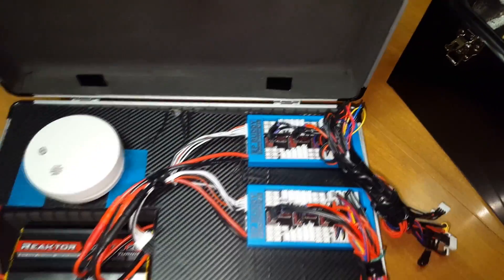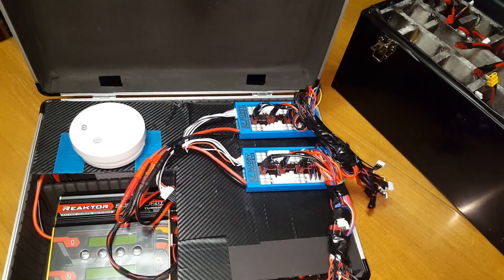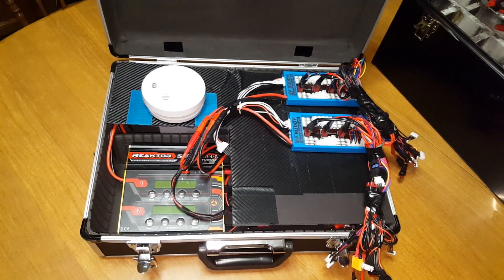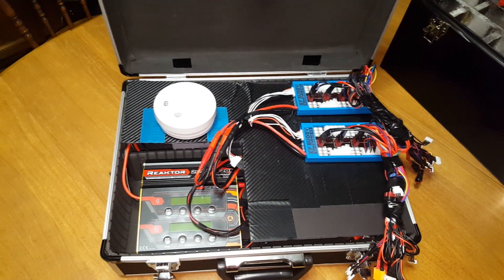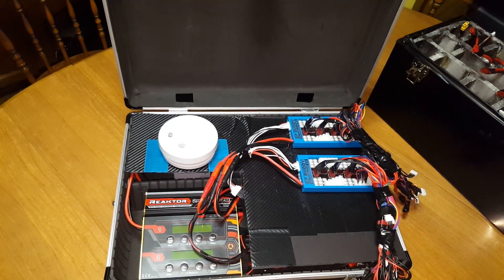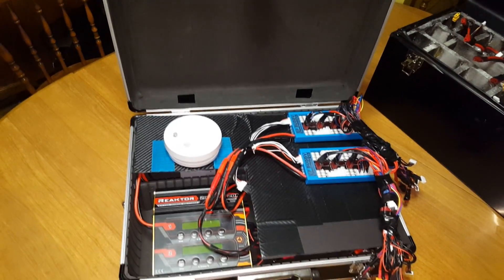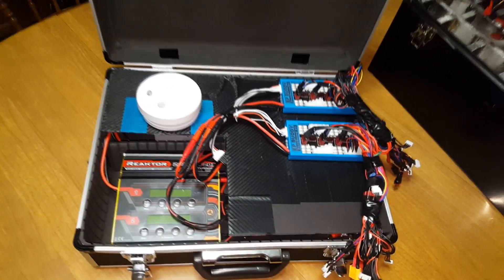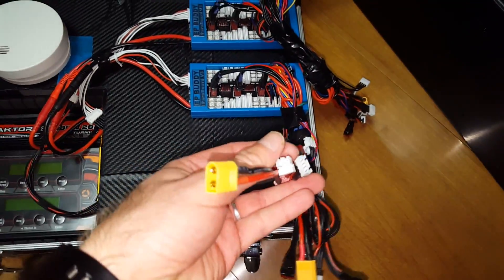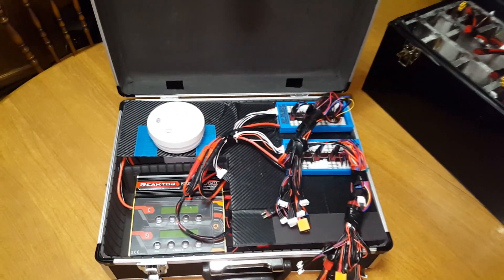Then I got these paraboards - EP Buddy paraboards version threes - so that I could also parallel charge two batteries on each one if I wanted to. You have to make sure that the voltage on both batteries are within 0.2 volts and that the batteries have the same cell count - 2S, 3S - and you add up all the milliamp hours. So if one was 2000 and another one was 2000, you charge at 4 amps that would be 1C, or 8 amps for 2C if you're able to charge at 2C. And I got these balance charging extensions off various Amazon sites for balance charging and for the connections to the batteries to make it easier for them to reach my charging area.